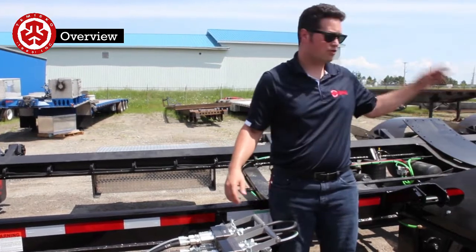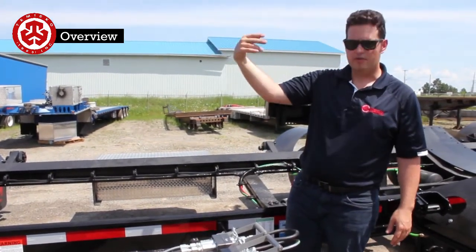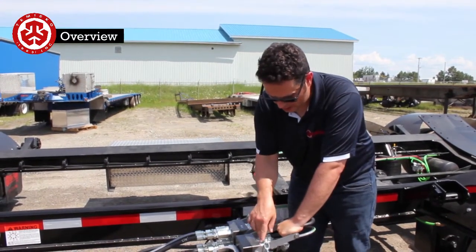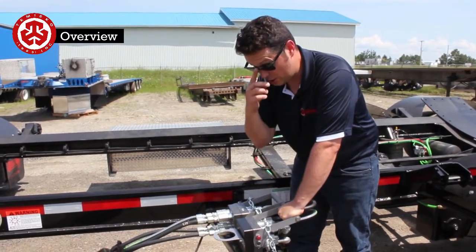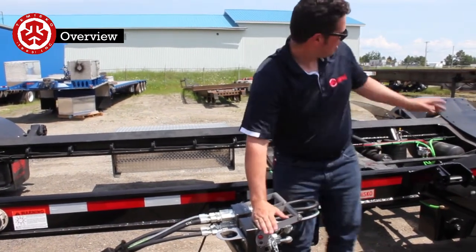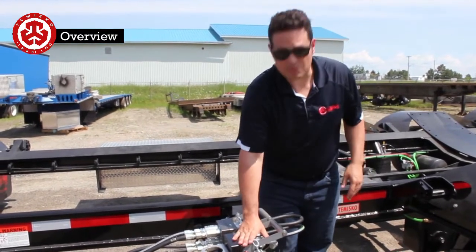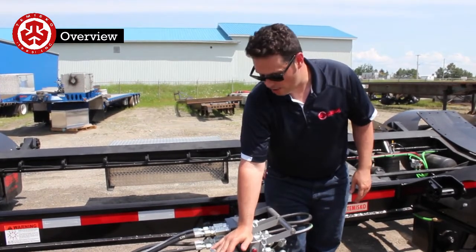So these axles will stay locked, and the front steering will be able to pivot freely. This one on the other side here, right now, all these cylinders are deadheading in here. So this is essentially locking all of the fluid inside. So right now, the locks that are holding the trailer straight is actually this being dead-headed. If this goes here, then you get an automatic steer.